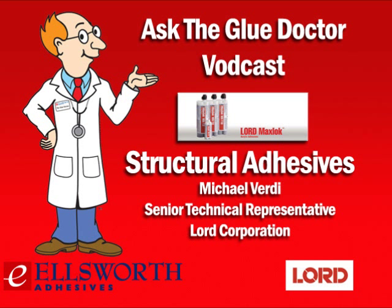Can you describe the type of chemistry available for use as a structural adhesive when looking to bond metal substrates? For bare metal substrates, Lord actually recommends an acrylic adhesive, often referred to as a methyl methacrylate-based system. During the cure cycle, the chemistry itself actually will etch the metal surface, providing a real secure, strong molecular bond on the surface. Lord has recently developed a new line of adhesives called MaxLock, categorized as MX-T3, T6, and T18. They are available in many different forms, ranging from small 50ml cartridges up to large 55-gallon drums or totes for metered mix dispensing equipment on high volumes, to help with the different ranges and sizes of applications.